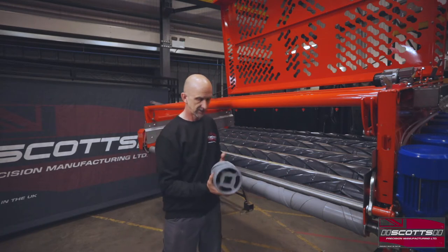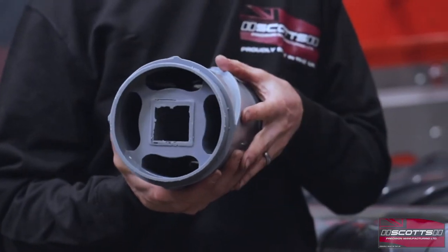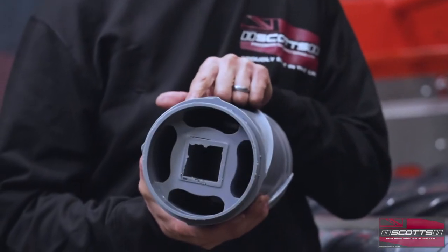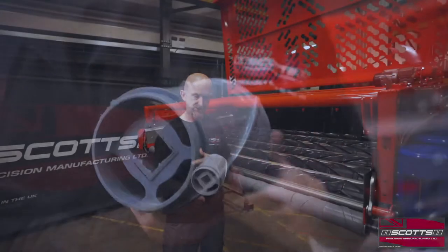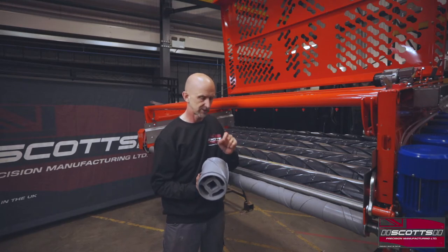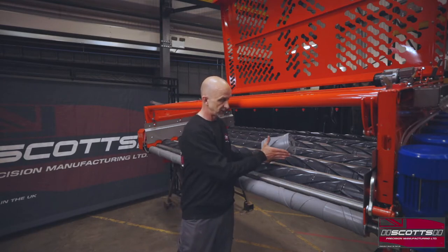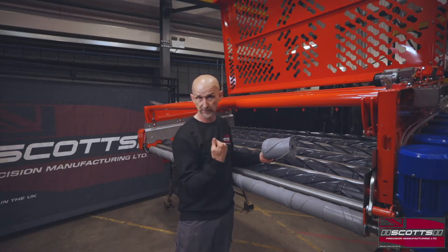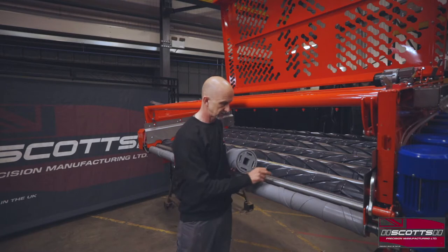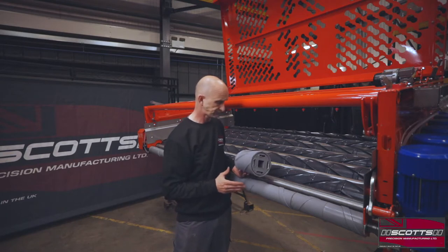For small potatoes, we would recommend a different roller. It differs from the standard main crop roller in a couple of ways: it has a larger body diameter, the ribs are only six millimeters high compared to ten, and there are only four of them. So as it rotates, it gets four bites of the cherry — the standard gets six — and they're smaller bites. The bigger body diameter also helps reduce the open gaps between the rollers, so even down to thumbnail-size, 16–18 millimeter potatoes, this roller with a stainless steel clod roller would be our first recommendation.